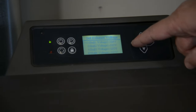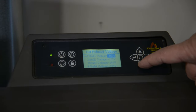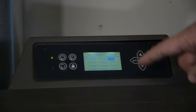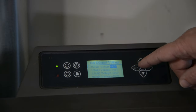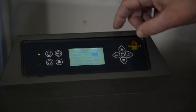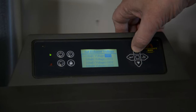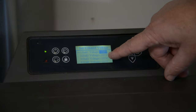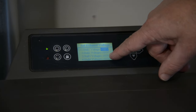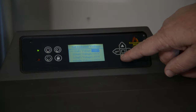If I'm on level one and I want to decrease it, I highlight it and then go down to whatever level I want, decreasing the noise level of the blower. You do not want to go too far as you'll mess up the efficiency of the stove. We like to keep level one at 100 volts, level two at 105, three at 105, four at 105, and five at 115.